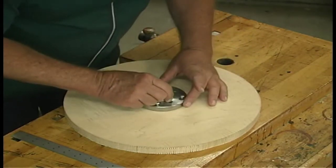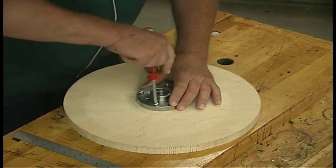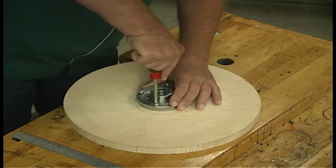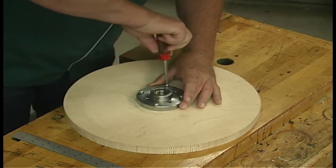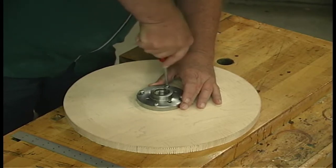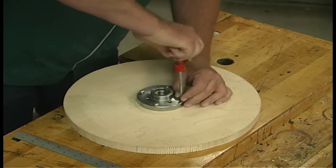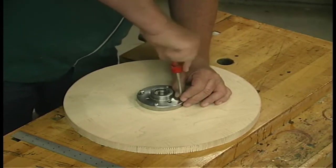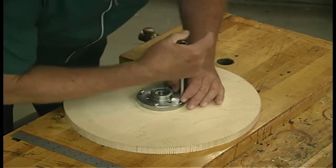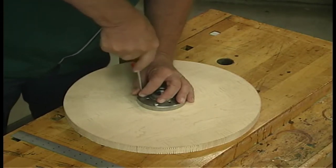The screws that I'm using are Robertson or square drive. I think they make a very good screw. They're sheet metal screws. They will self-drill themselves most of the time. Seeing how I've got a little money invested in that wood, I'm not taking the chance. I pre-drilled them slightly, just so I didn't take a chance of damaging anything on the tabletop.